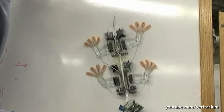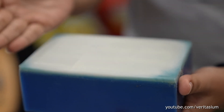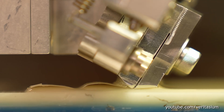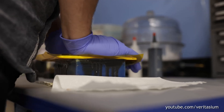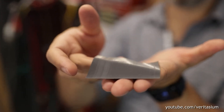The process of making it is also simple in principle. A block of wax is used as the base for a mold, and then a razor blade is repeatedly pressed into the block creating wedge-shaped indents. A silicone polymer is poured into the mold and a backing material is attached. The adhesive is cured and ready to go. And that's what it looks like.